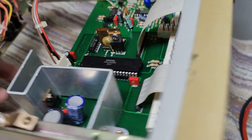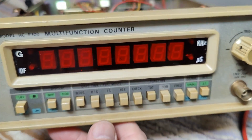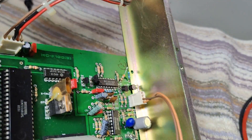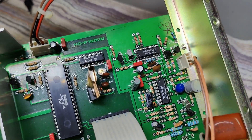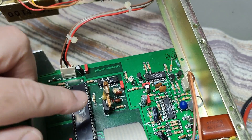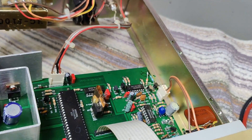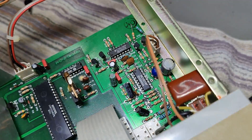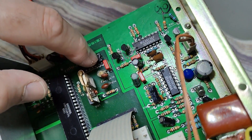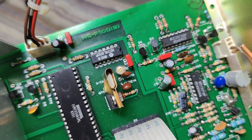This is what you need when you've got that many digits and it's able to do 100 megahertz. I have high expectations for this design. They say in the manual you need a 20-minute warm-up — that's obviously to get a stable temperature on that crystal. And that little capacitor here is where you fine-tune the oscillator frequency.